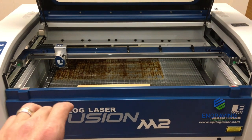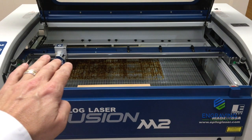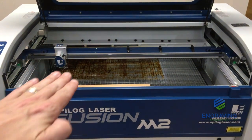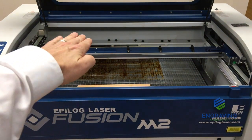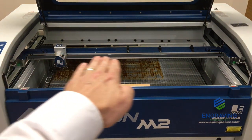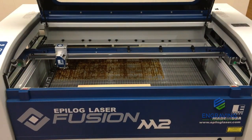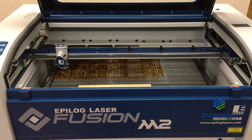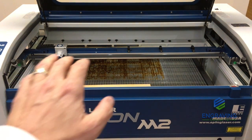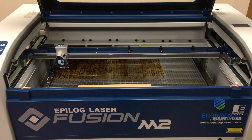Our concept was to ensure that as the carriage moves front to back, we use mirrors number one and two to get the target aligned front to back, and then we use the mirror on the x-axis carriage so that it's parallel to the table — aligned straight all the way across left and right. That is what a beam alignment is all about: ensuring that as the lens assembly moves anywhere on the table, it stays in that center position. Now we'll simply remove the lens assembly bullseye target, push reset, and that'll go back to home.